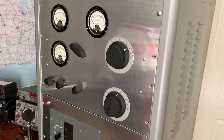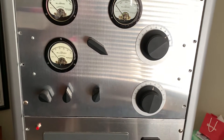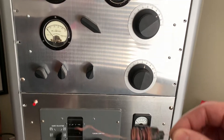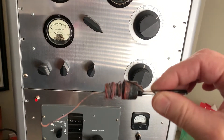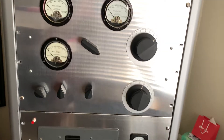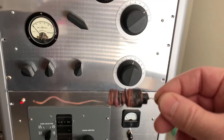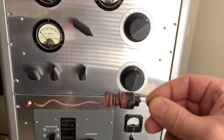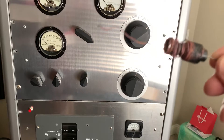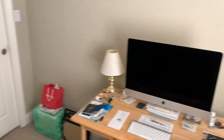That was why I fried those old loading caps in this deck — they were old anyway and probably going to eventually leak and crap out, but this choke made it happen right away. I just took a pair of dykes and cut this thing out of there, and now it's fine. I figured out why I've been having all that trouble. This was inside the remote tuner box and I was having an antenna loading problem because of this choke, and now I've solved the problem.